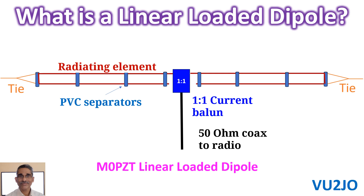I had posted about loaded coil dipole antenna earlier, which is a means of electrically shortening the physical length of a dipole antenna for those with space constraints, using a loading coil. It is useful for single band operation with narrow bandwidth. Of course, it is a trade off between performance and fitting a dipole into a shorter available space.